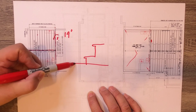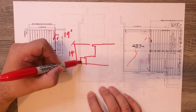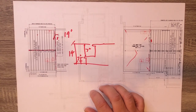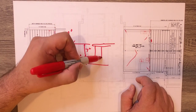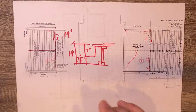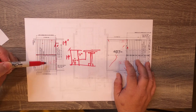That 14 inches works out really nicely because 14 inches equals two seven-inch steps, which are very comfortable to negotiate. And following along the floor framing, 14 inches is also the depth of the I-joists. So there are a lot of decisions working in concert: two steps at seven inches each equal 14 inches, and those 14 inches are synonymous with the floor joist depth. It's not a coincidence — that's design intent.